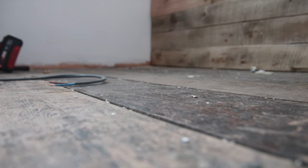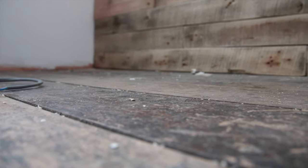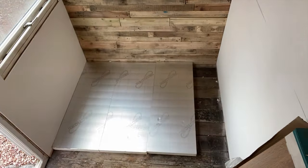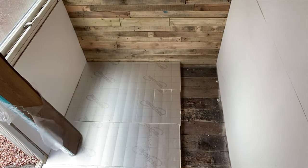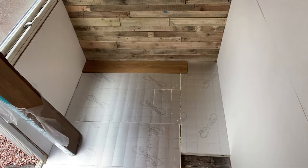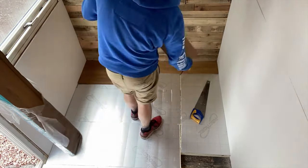When I built this shed several years ago I had used old floorboards, so there are a few small gaps which let in a draft when it gets windy. Whilst I had completely insulated the rest of the room, it felt like I would regret it if I didn't insulate the floor as well — so, more Kingspan sheets. To finish the floor I used some cheap oak effect laminate flooring, which is super easy to lay down, and not only will it protect the insulation, it'll also make the floor easy to clean after those inevitable paint spills.